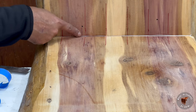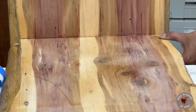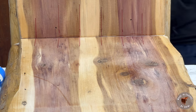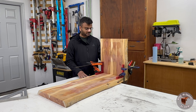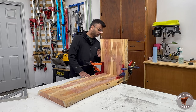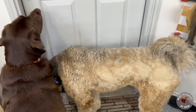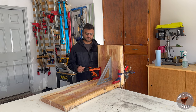The line looks a little off so I'm loosening the clamps and using a mallet to move things. They're still a little off but the glue is setting up and I don't want to remove the clamps and redo it. I forgot to record when I was clamping the L-squares. The whole glue-up is complete — I'm going to leave this overnight, come back tomorrow morning, remove the clamps, and see how the waterfall joint looks. I'm done working for the night — time to play with my dogs. The brown one is a chocolate lab named Apex, and the green one is Oreo, a golden doodle.